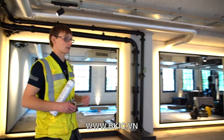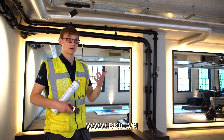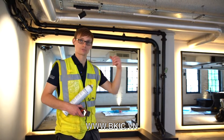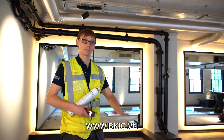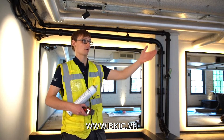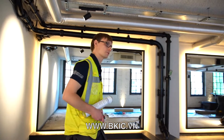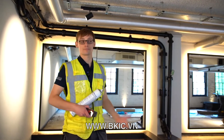The big issue with this project is actually nothing to do with airborne noise. Because it's a controlled space where clients are always working with personal trainers, they always drop weights onto very thick mats — it's always very controlled movement. But even when it's very quiet in the air, you can feel the structural floor moving, and that's the issue. The bare brick walls and bare columns look fantastic but are very bad acoustically — the energy goes into the structure and resonates straight up through, rattling the floor above.